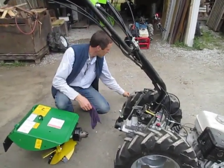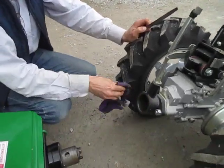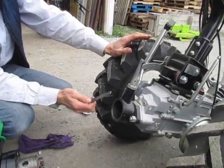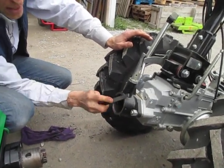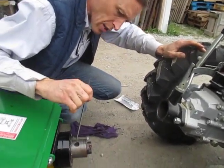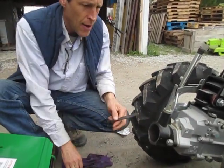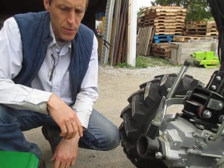It has happened that, as I mentioned earlier, the factory actually puts too much paint on this surface here — sometimes they paint it very heavily. We usually try to take most of the paint off before they go out of here. But if the surfaces are clean and you still can't get the pin to drop, take a big flat file and just file this surface down — just take a little more metal off of it, remove paint if it happens to be there. You can do the same thing on the plow surface. Just rub your file right across it and take off any material that might be there. Then make sure to wipe out any filing grit that might get in there and re-grease it with a little multi-purpose grease.